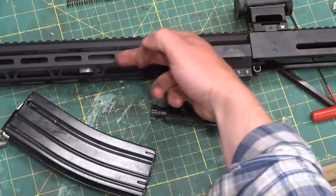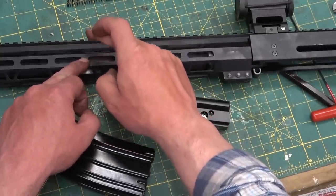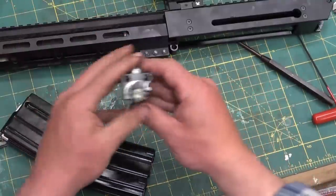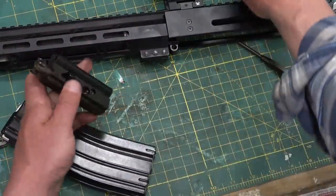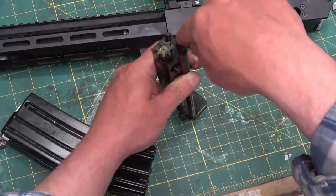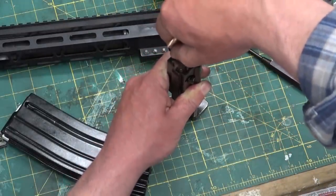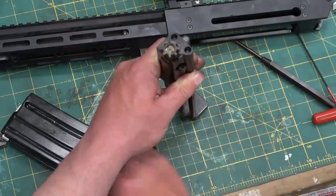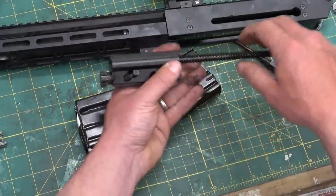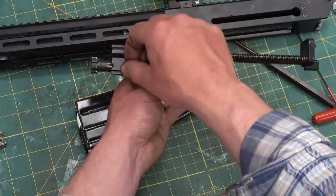So the projectile comes down the barrel until it hits these ports, these gas ports in the gas block. And that gas gets used to extend a piston in here. And you can see its witness mark, what it's been striking on. And of course this bolt slides on the sliders like so. The piston pushes everything back, ejects this round, gets looped into that little claw there, and that brings the brass out. And then on the forward stroke, it peels off another round out of the magazine, brings it into the barrel, indexes with the breech, and then locks it in place with this little rotary motion, and then you're ready to fire another round.